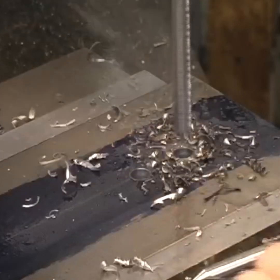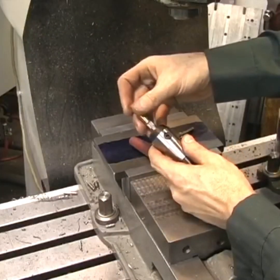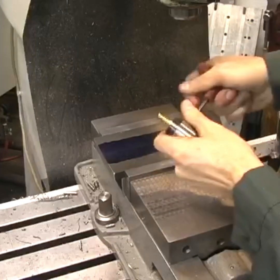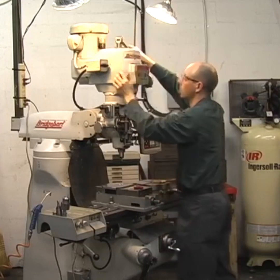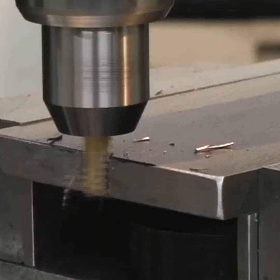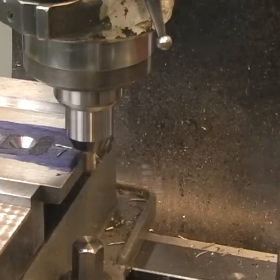This is the mounting piece that the workpiece is going to be held with onto the rotary table. Just drilling and countersinking some holes here, and then I'm going to mill some slots for mounting it. When I use an end mill in the milling machine, I always like to use end mill holders rather than a collet — collets are notorious for letting the end mill slip out, and before you know it you're cutting much deeper than planned. The Bridgeport does a good job making the slots on the end of the plate.